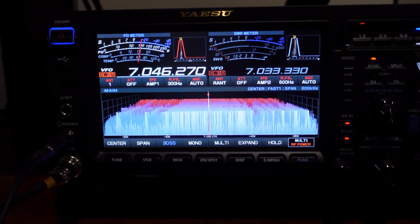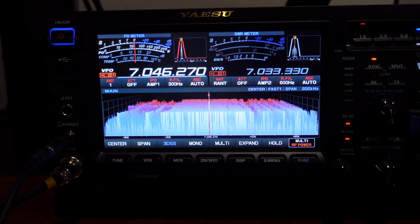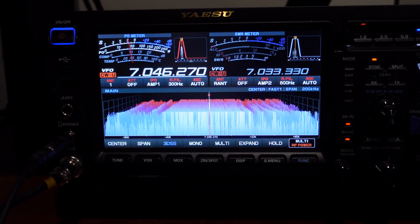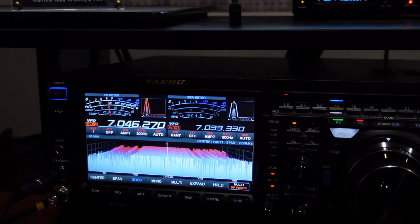Just on and I've already got about 40 countries. The HF2V is my favorite antenna for a vertical — at 33 feet with small wind load, 60 radials under it. As you can tell, S9 plus signals almost all the time. It's a great performing antenna. If you're thinking of an antenna for 40 meters and you've got limited space, that HF2V is a real winner.